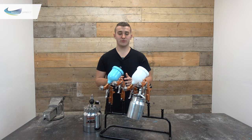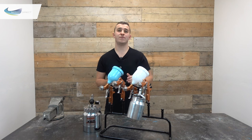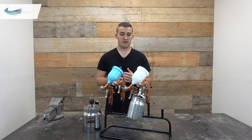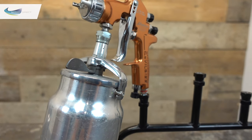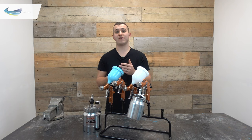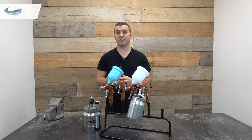We have 3 main options. First is gravity — the cup is on top of the gun and the material flows down into it. Next up we've got suction, where the pot hangs underneath the front of the gun and works by the high flow of air passing over the top of the cup and drawing the material out with the venturi effect.